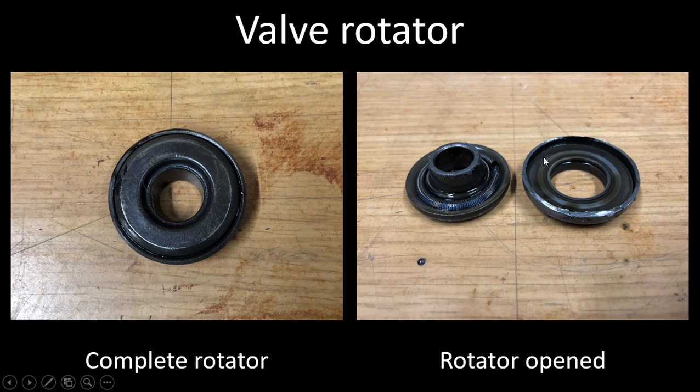What I'm finding on these — when I'm seeing uneven heat signatures on cylinders that have some time on them — I'm finding wear in the garter spring. One of the things I want you to pay attention to is this land on the center of this boss, and then this area here — these are stops in the valve rotator. They limit the amount of compression that is applied to the garter spring. That's an important thing that I've been finding out about.